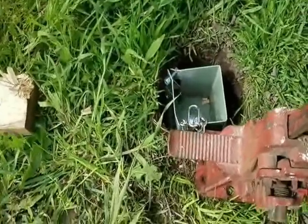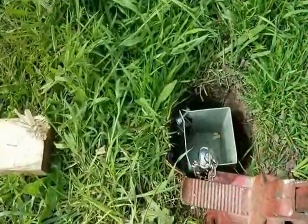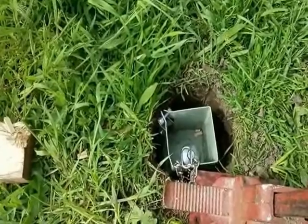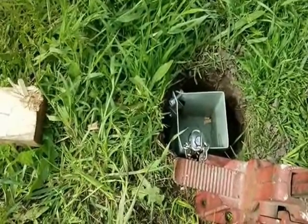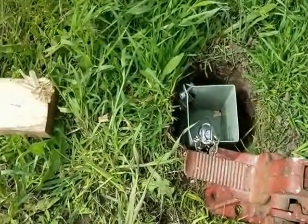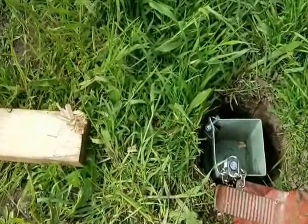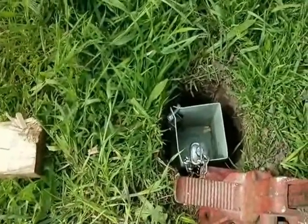What I'm doing now is I got this chain connected to a jack here, then wrapped the chain around that four-by-four holder. When I jack it up it'll pull it right out of the ground — easy peasy. After this I'm going to get myself a hole hook. It looks kind of like a metal pot with screws on the inside so you can change the diameter, and there's a metal rod that comes out of the top to keep the angle of your hole true. On the front are two hooks where you connect a chain and pull it, because the front of the pot has these little worm gears that spin and move the dirt from the front all the way around to the back.